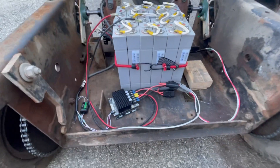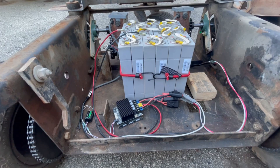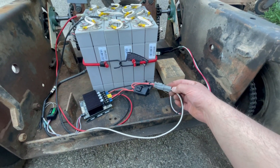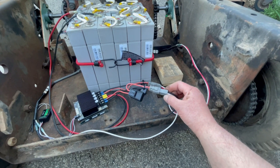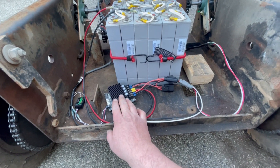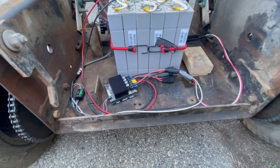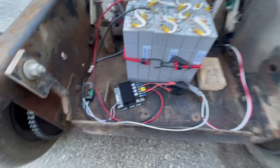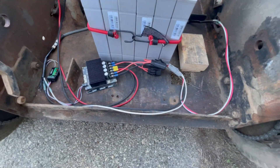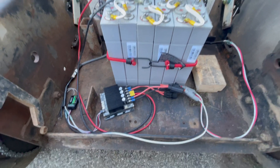That's the first time I've had something remote controlled, so it's been different trying to learn how to run that. One more thing about the motor controller: these connectors here are actually only rated for 13 amps continuous, so they should be larger. The output of this motor controller is limited to 30 amps output on each side - left and right drive - so I should have the next step up connector for those.